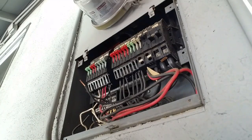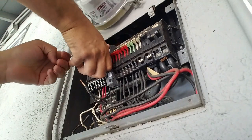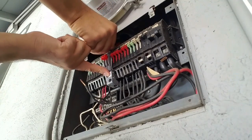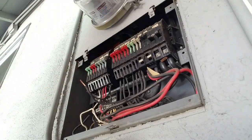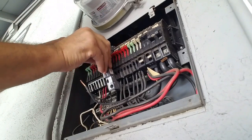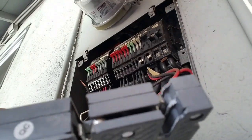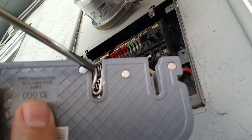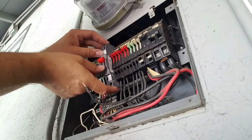A new aftermarket tandem. So I'm going to go ahead and put it in here. You've got to be careful — these aftermarket breakers have a little tab right here that sometimes sticks out too much at the very end to reach the bussing. Sometimes you have to open it up just a little bit, though you don't really want to mess with it too much.